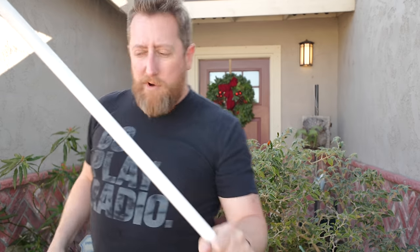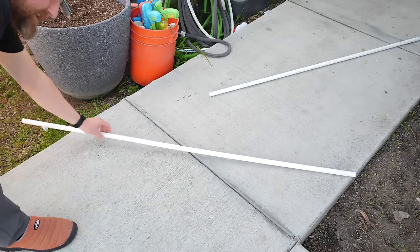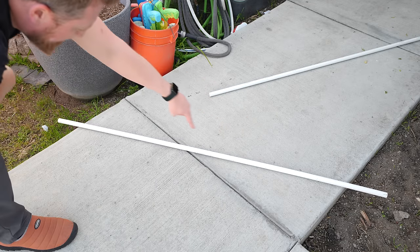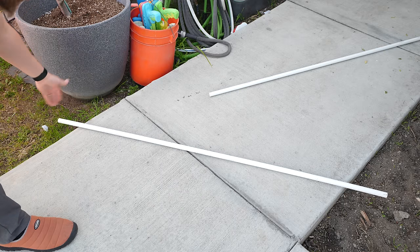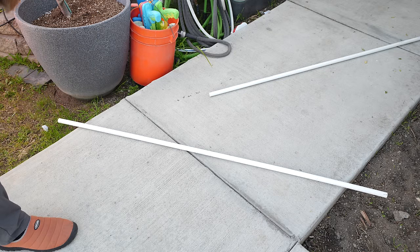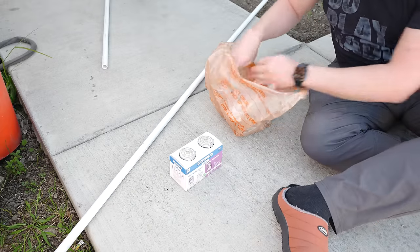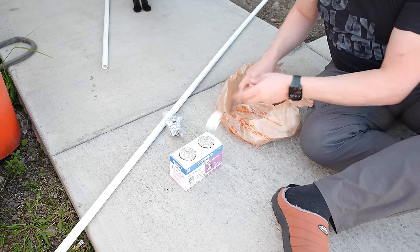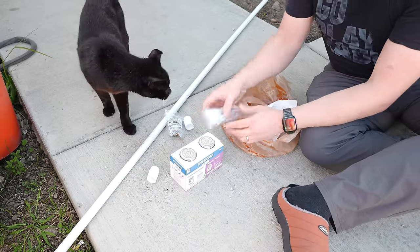My estimation is that I'm going to have to go underneath the walkway at kind of an angle about that far, dragging the coax from this end through. I'm going to bore in this direction after digging a trench on both sides. I'll make it about this long — there'll be fittings on both ends giving a couple of inches on each end. I always buy PVC primer and cement, and then I never use it and it goes bad, so I always expect I'll have to buy more.